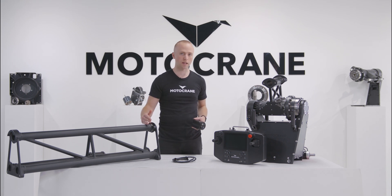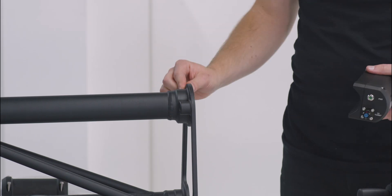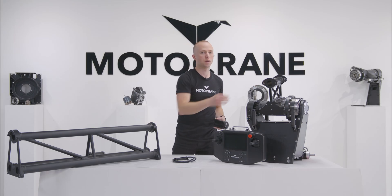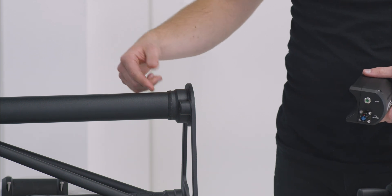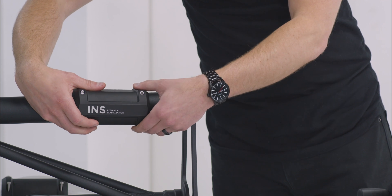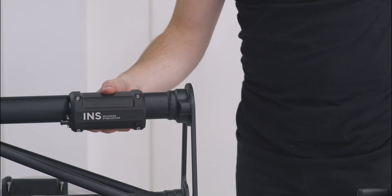I'm going to make sure that I'm working on the correct side of the middle boom, which is going to be the male side that has the clip — not the clip receiver, which gets installed onto the fulcrum. Make sure you're on the correct side, then measure 45 millimeters, which is just under two inches, from the inside of this weld. That's going to be the distance at which we mount the INS sensor.